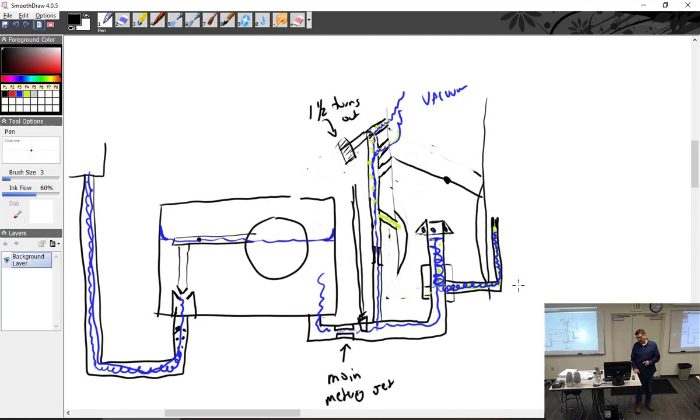So you put the carburetor together, you put it on the aircraft, and you run it up, and you pull the idle cutoff, and it just keeps on running. How come it just kept on running? Because the valve's over here, it didn't get in the hole. Actually, it's really hard. You've got to look down in there and then put it in. When I built carburetors, I'd actually blow on it, and if it's quiet enough, you can move it and hear the air change. So that's really important. All right, so we got that one.